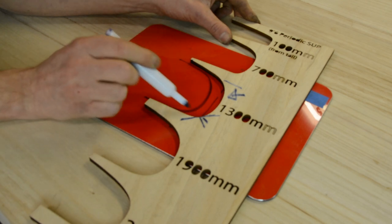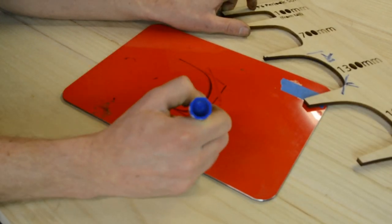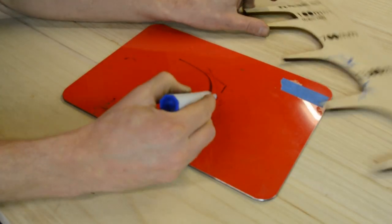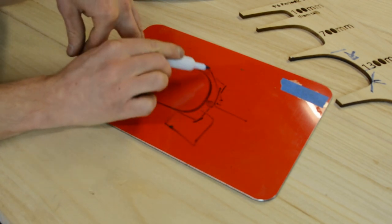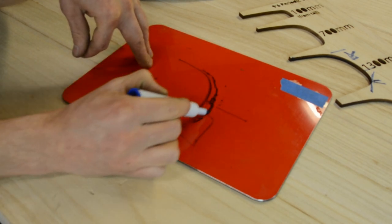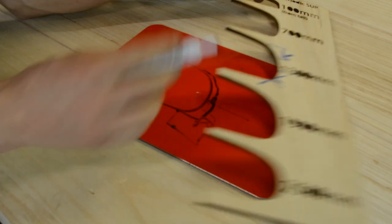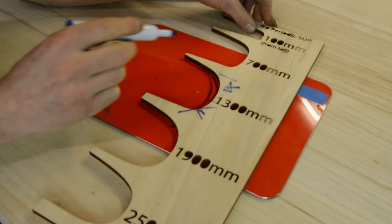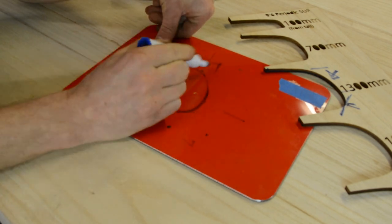What we're starting to do is hit that bottom corner with the template, which becomes a roadblock. That isn't necessarily an issue because we can look at this arc as terminating at about midway down the board. So we can create a flat here and here and still be safe for our profile — left with something a little bit oversized but close to our end profile. Once we have most of our radiuses close but not quite there, we'll flip the board over and bring the bottom edge to where it has to be, then work on the top to remove the excess material and finalize the shape.